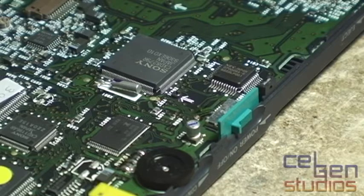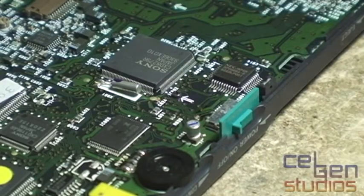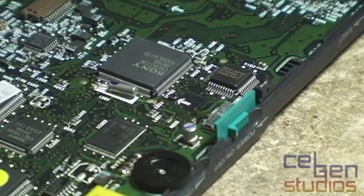Often you'll find yourself burning the pads for the capacitor, and if that pad travels into a trace or there's a trace directly under it, you're in serious trouble because it's going to be a complete pain figuring out how to get that back. I don't really enjoy mechanically removing components off boards — that could be as simple as flexing the backside of a board with a BGA chip and knocking with a hammer, or with QFPs just popping the pins out and pulling them up, like the Motorola 68,000. But in this case here, it works, and I don't understand that. Let's get to that.